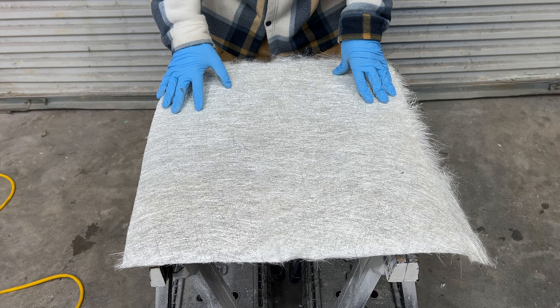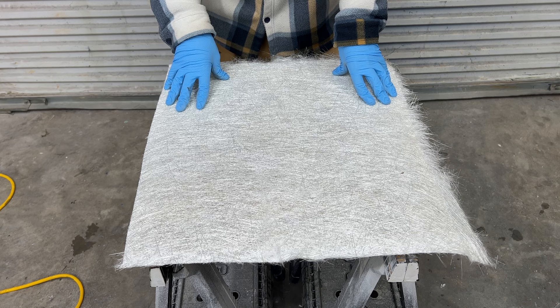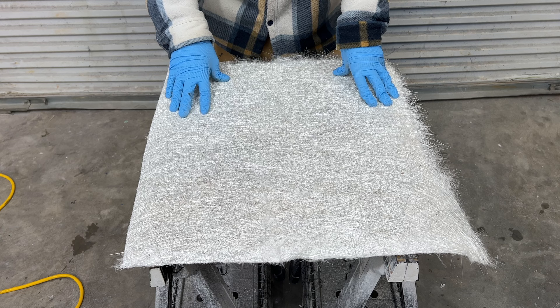So now I've got the surface sanded. I did go back to my 6-inch sander just to speed up the process. You want to blow out any contaminants and dust, and I always like to wipe it with a little bit of solvent — lacquer thinner or acetone. It doesn't really matter as long as it wipes it down.